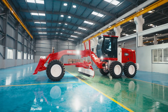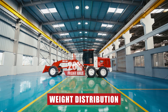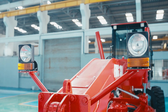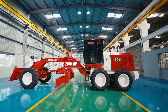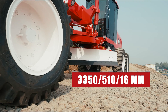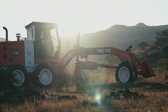The FMG 130, weighing 9.1 tonnes, guarantees stability through a 28% front axle and 72% rear axle weight distribution. The moldboard base spanning 2100mm, with moldboard dimensions of 3350 x 510 x 16mm, enhances efficiency, making each pass more productive even in challenging conditions.